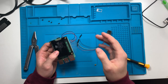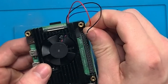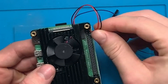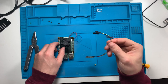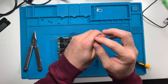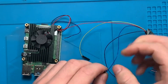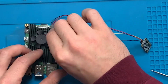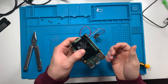If you really want to connect the fan, connect the 5 volt wire to the 5 volt pin in the top right, and then the black ground — count down by one, two — so there's a space between the first 5 volt pin and then there's a ground. There will be a pin-out diagram so you can see it all. As for the BME sensor, it's really straightforward — it already comes separated so you don't have to worry about disconnecting any cables. The red pin goes to the top left which is 3.3 volts, followed by the blue pin right next to it, then the yellow pin right next to that, and then the black ground pin with one space, and that is plugged in.